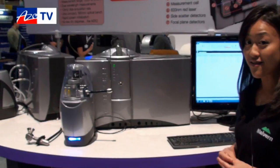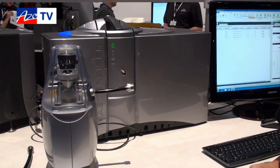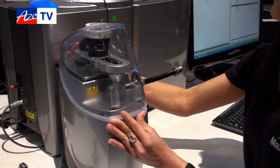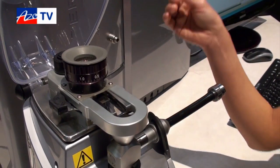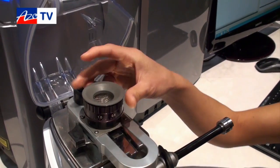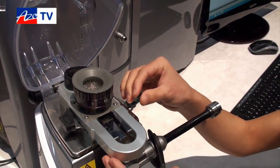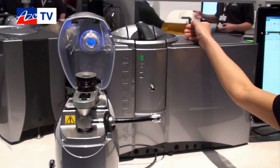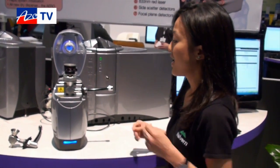You may be familiar with the 2000 already, so what I'll be doing today is to introduce you briefly what's new and what's different. Starting from our dry powder dispersion unit called the Aero S. As you can see we have redesigned everything from the ground up. The way we introduce samples is different — you put your samples into the hopper, adjust the height of the hopper to see how much powder can flow through the vibrating chute, down into the venturi, through the measurement cell, and get collected by the vacuum. Everything is driven by the software — air pressure from zero to four bar is all controlled by the software alone. Everything is automated.